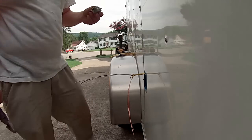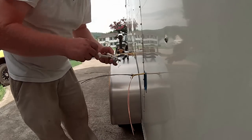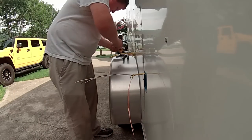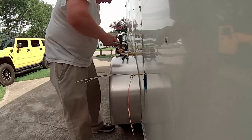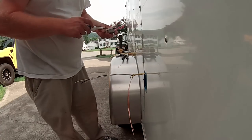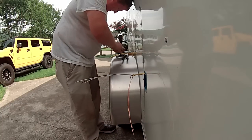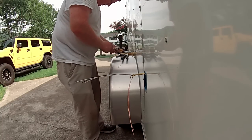You guys probably know about this, but you've got the 15-amp duplex here, and there's a little bar inside this thing that actually connects both circuits. From the factory, the top and bottom are the same circuit, but you can disconnect that bar so that you can have something like a switch lamp.